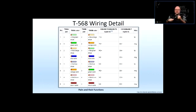When it comes to Cat6, category 6 cable, and up, all four pairs are being used. In Cat5e, just the green and orange pairs are being used. In Cat6 and up, the blues and browns are also being used to transmit signal. So if you're going to make a crossover cable which involves Cat6, you also have to switch the other pairs because they're being used at this time. So you not only have to switch oranges and greens, you also have to switch blues and browns. Okay, so mystery solved.